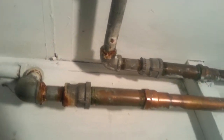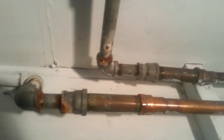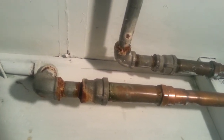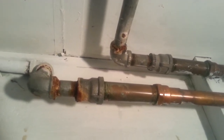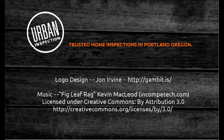So this is what you should look for when you're looking down in your basement or in your crawl space and you see plumbing. Check it out, see if there are dissimilar metals going on. And if you see that there's a lot of corrosion, it may be time to get an expert plumber in here and have them look at it and maybe make some replacements.